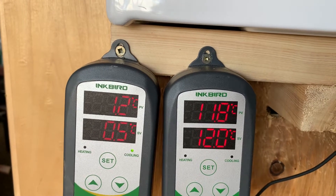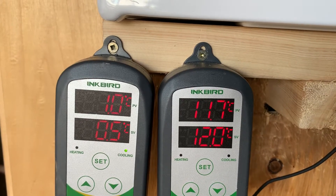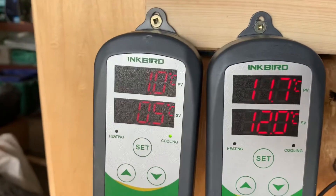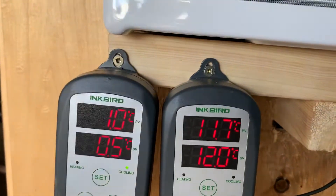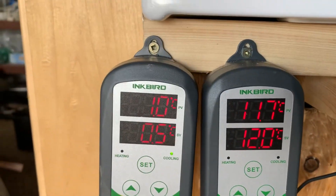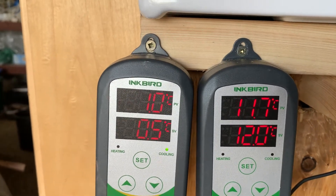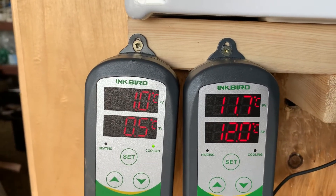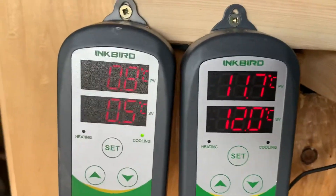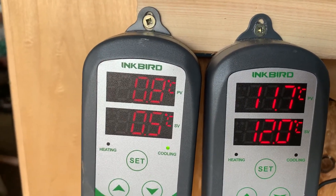It's coming up — oh, it's still going down actually. So the idea here, by setting this one to just above freezing, zero degrees Celsius — if it gets to zero, it'll shut the whole thing off and warm up and cycle again. And then of course on this side, 12 is a little bit warm, probably need to get down to eight degrees, but I'm just experimenting here and I don't have it all taped and sealed.